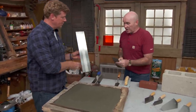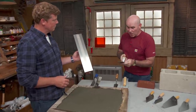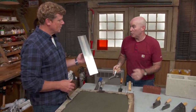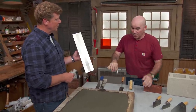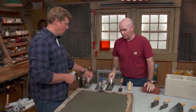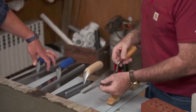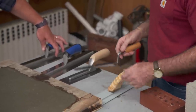And then this guy next to you? This guy right here is the same type of margin trowel but it's a finishing trowel. A longer handle is going to allow me to get into a deeper spot than I normally would be able to. And would you use both sides, square side and rounded side? If I had a pipe that I had to get around and I needed to do it on my backhand, that edge is going to allow me to do it. And then the other one? So this one here is what we call a duckbill trowel. Love that — looks like a duckbill. And again, it's just going to allow me to get to places that I normally wouldn't be able to get into.